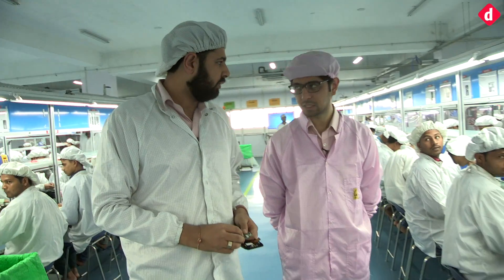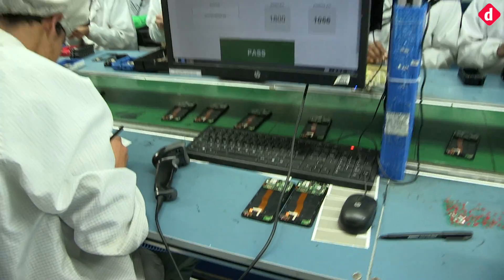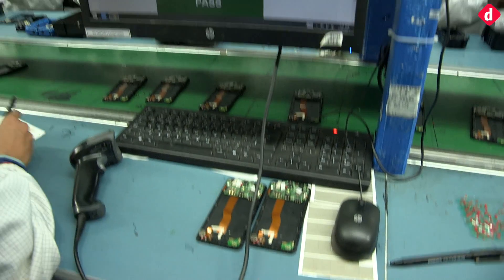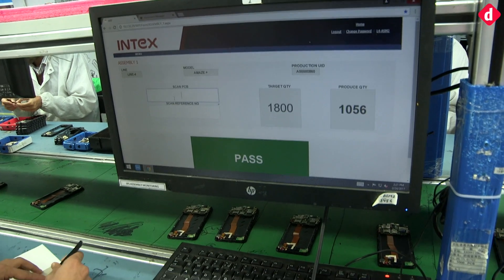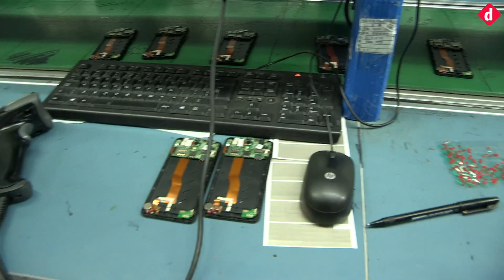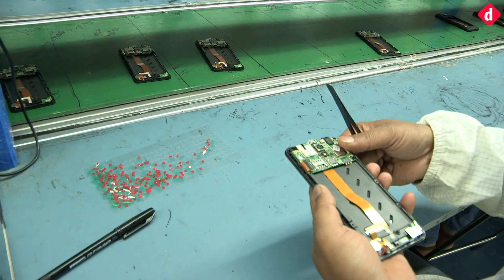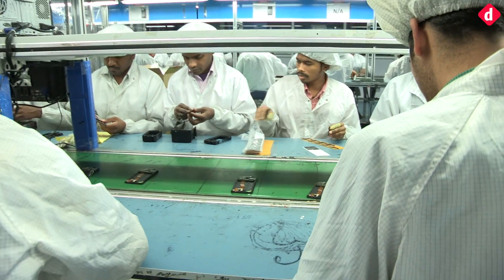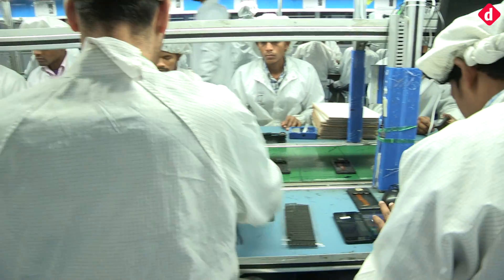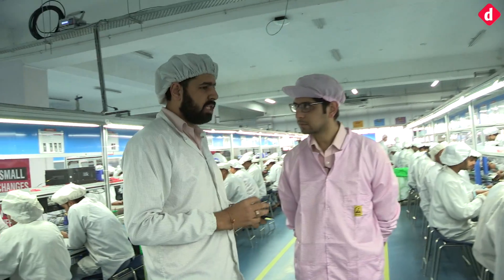If we are working double-shift operations, in a single day we can manufacture 60,000 units. When all these components are being assembled, they are being checked by operators who also have information on screen. This is our IPS system — the Intex Production System — which tracks how many sets are flowing in the conveyor line and how many sets are assembled. It is installed in all our conveyor lines. There are five steps in this IPS. The first step is the input step where the operator pastes a barcode label on the PCB and scans it, so that particular PCB is entered into the system.